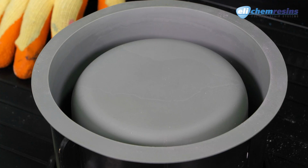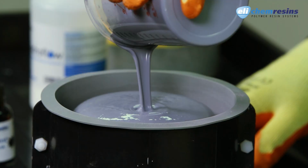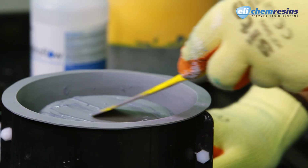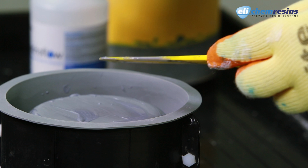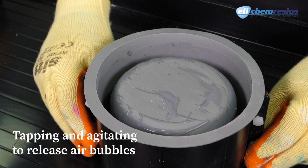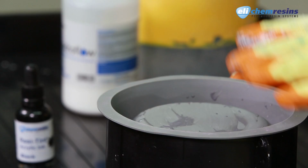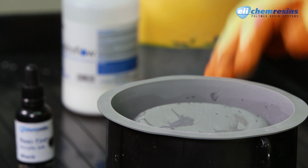Right, and it goes cascade over the top and down the sides. Just kind of push, because we don't want any of it on top here. We want it all the way down the sides. Then we're going to leave that to partly cure for about an hour before we add to the top. So that just self-levels the hydroflow and allows any air bubbles to come out.